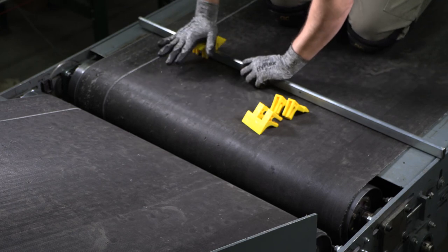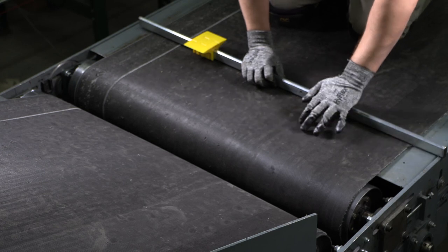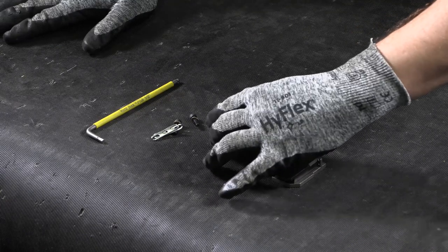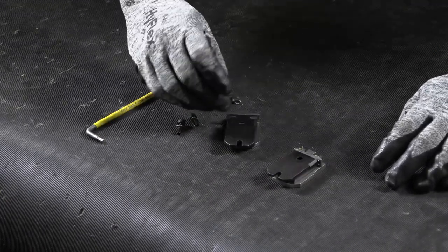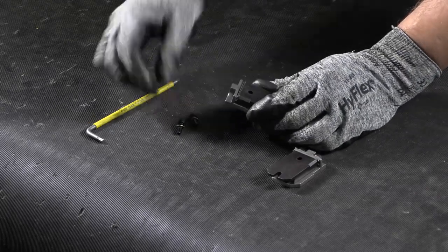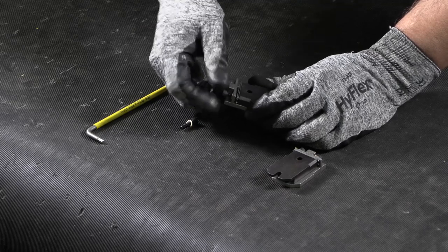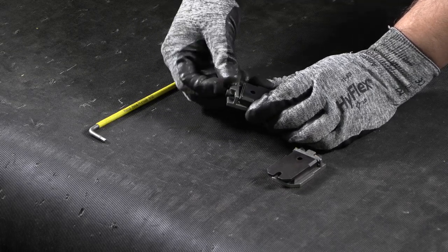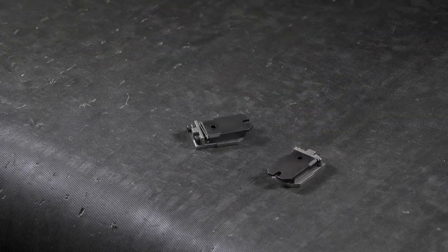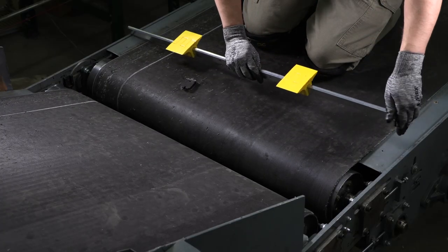Slide one segment pair onto the bar from each end and position each approximately one quarter of the total bar length from the end. Assemble the provided brackets. Tack two shims on top of the back plate of each mounting bracket. Using the socket head screws and washers, attach the front plate to the back plate, ensuring that the shims are in place. Align the edges of the front and back plates so that the vertical edges are parallel. Tighten the screws to compress shims, making sure there is no interference with the pole end. Slide one mounting bracket assembly onto each end of the bar.